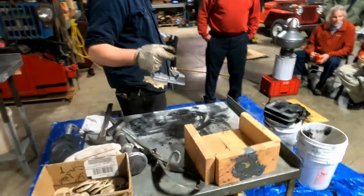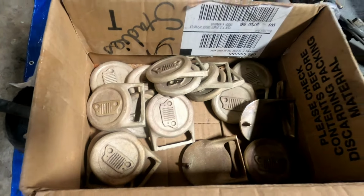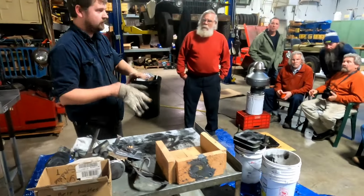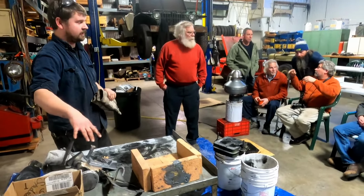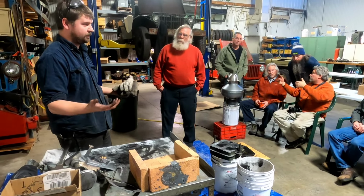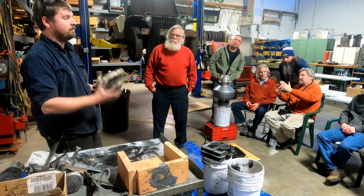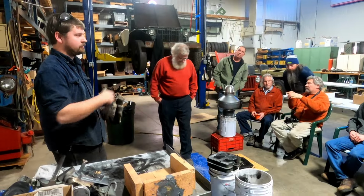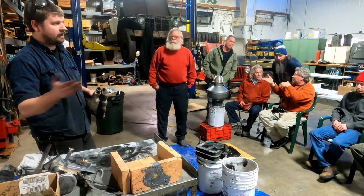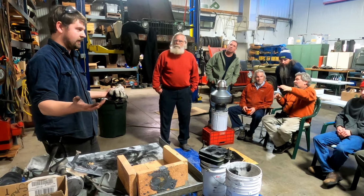Is there a maximum number of times you can remelt and use it, due to loss of the heat? So what you'll do is you'll lose alloy. In this, I'll burn off zinc and tin. In my aluminum, I run 356 aluminum, which is what we use on airplanes. It's aluminum, magnesium, silicon as the main elements. The mag burns off. So I always have to keep throwing magnesium back into my pots to keep it in spec. If I run out of mag, I won't get the proper microstructure, and I'll lose all my strength.